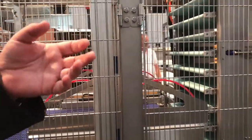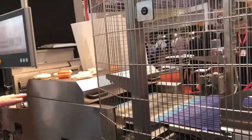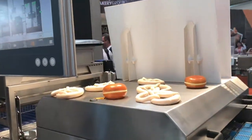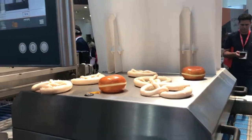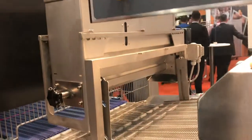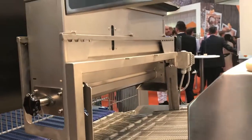Put it back into the rack. The rack goes to the proofer, and after the proofing process you can put the rack back into the machine and every piece of dough, every setter, is collected by that lift fully automatically. Then the dough will be handed over to the caustic soda line — here we have a caustic soda shower system. Next step is a salting device which is automatically started when the dough comes to the area, so you don't have too much salt.